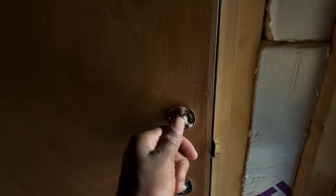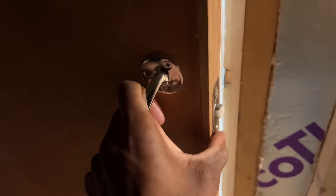Now there's an additional thing — fixing this loft door. When you shut it, it doesn't shut properly; you need to actually slam it really hard. I'm going to move it over on the hinges because there's a bit of room, and if I need to plane it a bit I'll do that. This latch is also a little bit faulty so I'm going to chop in the latch a bit and get it latching properly, because at the moment it's very stiff.